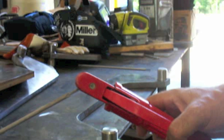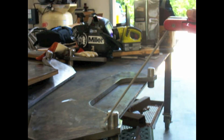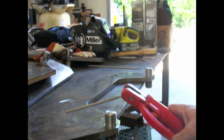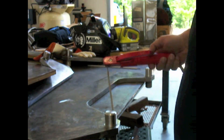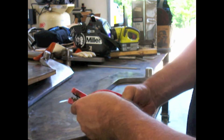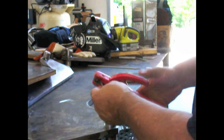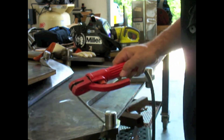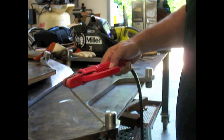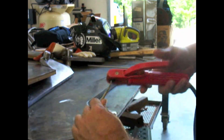Most people chuck a rod up naturally like this, but that's not really comfortable for getting around a round part. You kind of have to cock your wrist up and it puts you in a little bit of a bind — it just doesn't work that well for keeping a decent rod angle going all the way around. This position is a little better, and this one is even better. Put it the other way and all you have to do is twist your wrist — see how the rod angle stays more consistent. What's even better is putting it up in the end and bending it, kicking it back. Now it's really a lot easier. I'm comfortable; I just have to move my wrist around a little bit and hopefully make it all the way around with a decent rod angle.